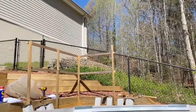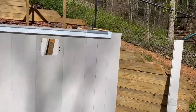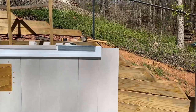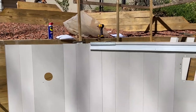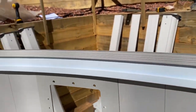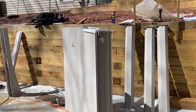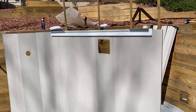All right, so today we're starting to install the walls. This is the exciting part because it's starting to come together. For the Intrepid Pool, the first step is to start over an upright boot and center two regular slats. And once you do that, within the first five feet you need to install your skimmer panel and your return panel — no more than eight panels between the two, which I've done. So I put on my beaded receiver here and my top rail, and that is holding it pretty good. We're not supposed to have any rain or wind for the next five days, but we're committed now, so we're going to get this wall up today so it'll be stable. And we'll put the liner in in a few days.